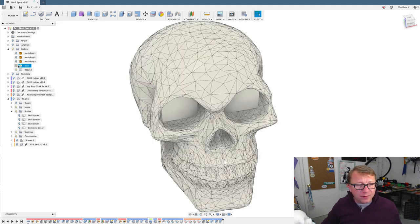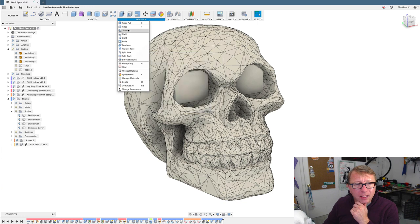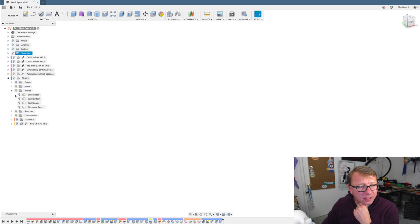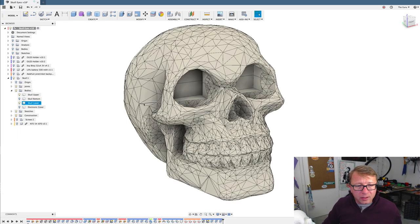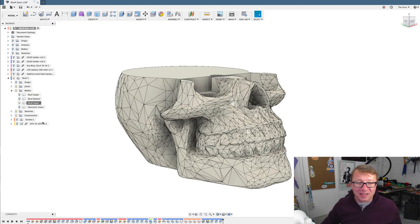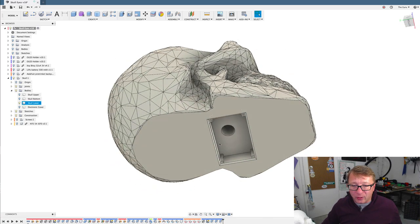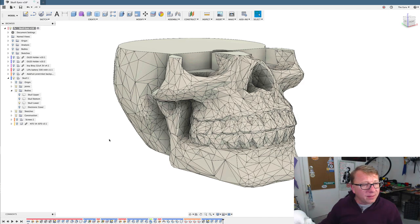The magic here is: once you have the skull and you do your parametric modeling, you just say Modify > Combine and then you subtract this body from that body — and then it creates this void. Then I used a plane to cut the head in half, which leaves what you would expect. I created this little cavity in the bottom separately, but it is the exact model required to fill in this work for the eyeballs.